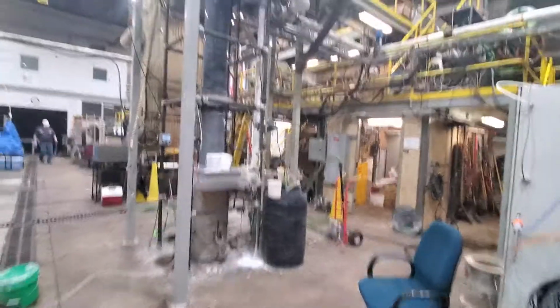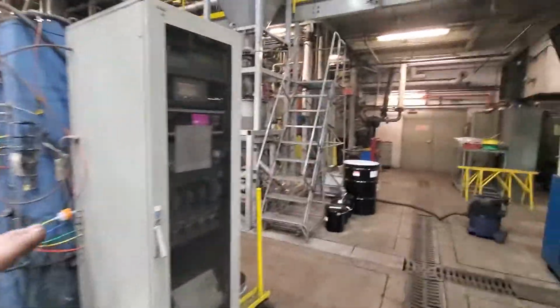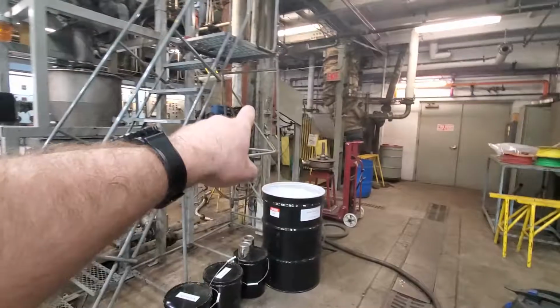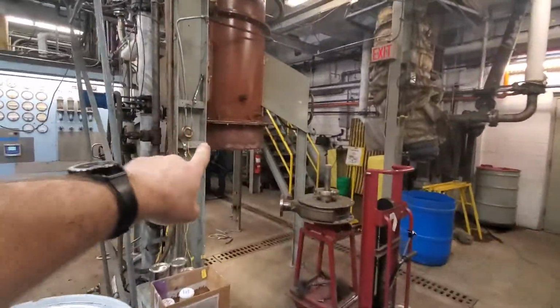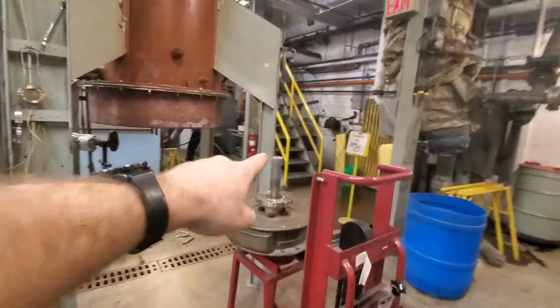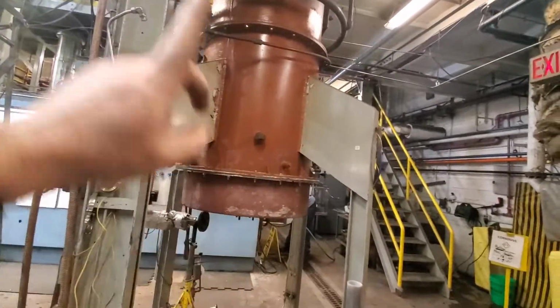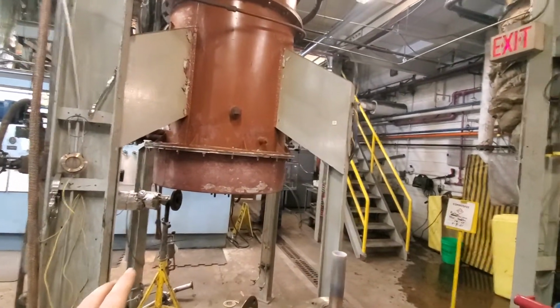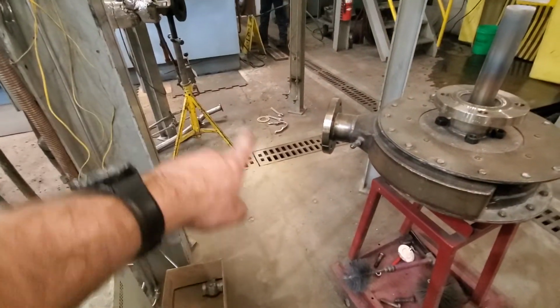All right, so here we are on the floor in the middle of the maintenance turnaround. I just want to cover what's going on. The engineer is taking the bottom of the combustor part. I showed that in a video. Cleaning the coil out, checking the burner, going upstairs, blowing down through the heat exchanger, and then cleaning out the anhydrous injection port. You can see the material that comes down on the floor here, all the ash and stuff.